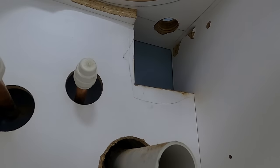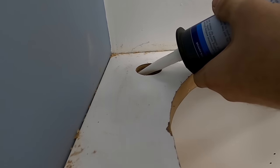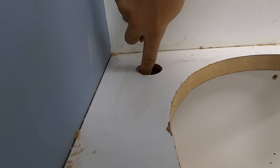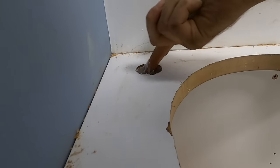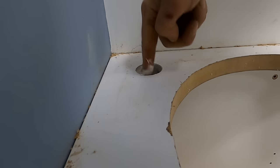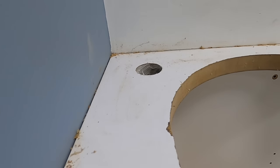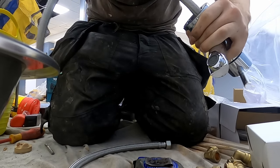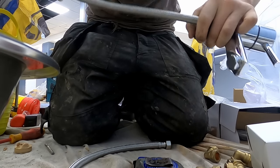What I need to do is seal the edge of this worktop because if any water gets down there it's just going to blow the chipboard. So I'll just use some silicone - I'll do the same around the basin cut out. That'll just stop any damage to the worktop if any water did leak. It's nothing special, just some silicone. Then we can get the tap in - we've got the world's longest flexes. When they come with them you don't have a lot of choice.